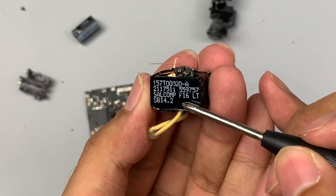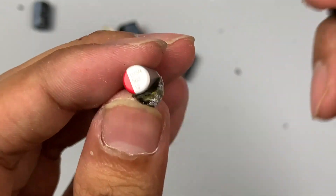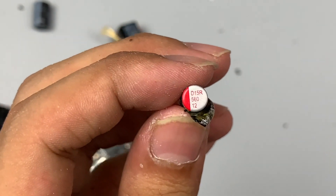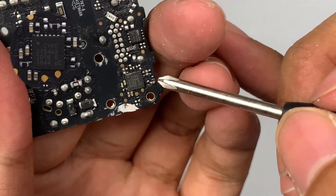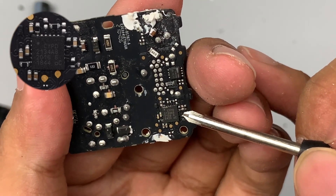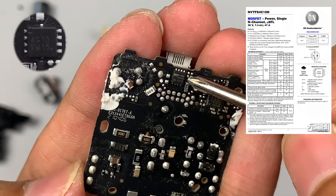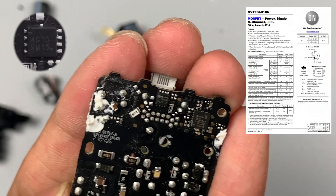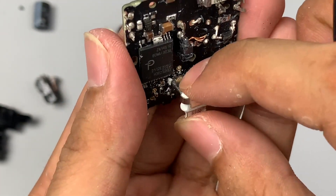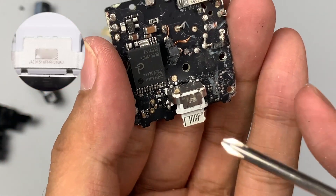The synchronous rectifier MOSFET comes from Diodes Incorporated, marked T89. The solid capacitor for output filtering is wrapped in tape for insulation, rated 560μF 12V. The protocol chip comes from Infineon, model CYPD2134, which complies with the latest USB PD standard and can support passive cables, active cables, and powerful accessories. The output VBUS switch MOSFET comes from ON Semiconductor, with a rated voltage of 30V. The USB-C port is plastic and protected by a metal shell for reliability — it was made by JAE.